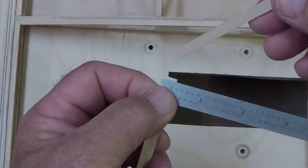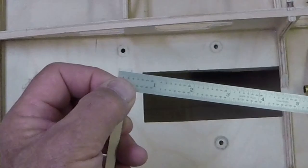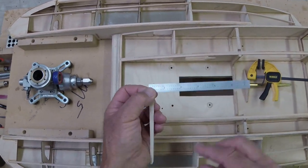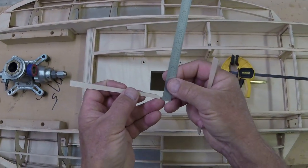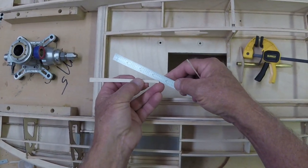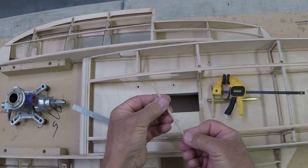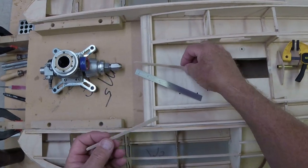The floor itself is one-eighth of an inch, plus another three-sixteenths, and a tiny fudge extra because we're going to wind up sanding it into shape. Don't forget to account for that one-eighth-inch floor. Same thing in the front: one-eighth inch floor. You can see where I did that flat and then cut a taper on it — no particular angle, do whatever you want. Stick them together, grab your sanding board or walk over to your belt sander and buzz the taper into it.